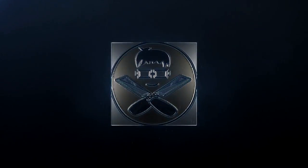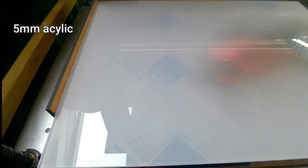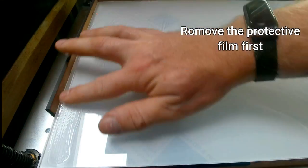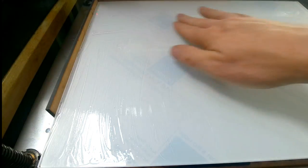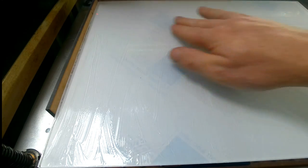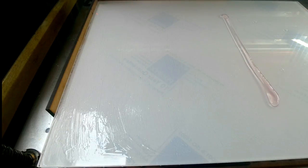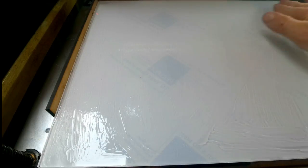Now let's get into the video of how to make this plaque. To make this plaque I used acrylic, and when you're engraving on acrylic you want to cover the top layer with some washing-up liquid. What this does is it stops any of the smoking effects from the engraving and it just leaves you a nice clean acrylic surface that you don't have to go back to with acetone or alcohol, because if it does get any engraving residue it can crack and doesn't look great.